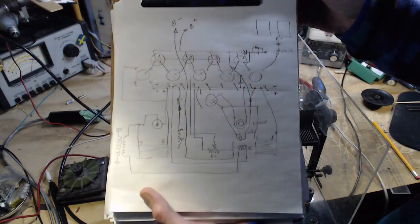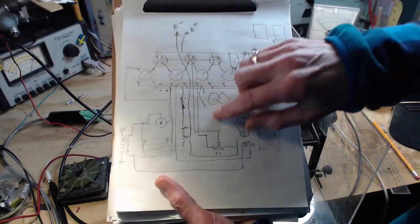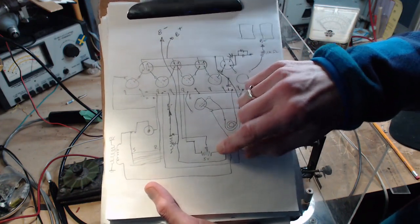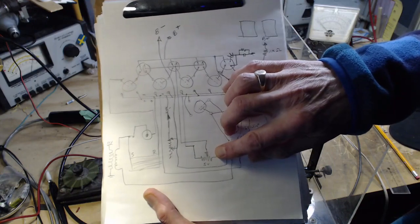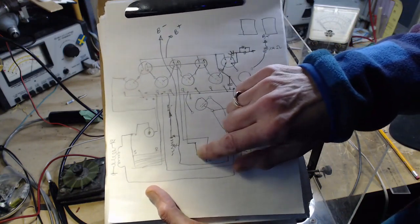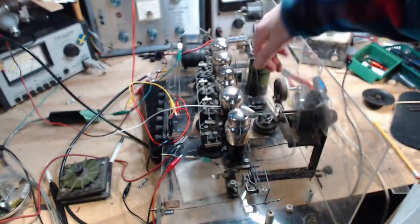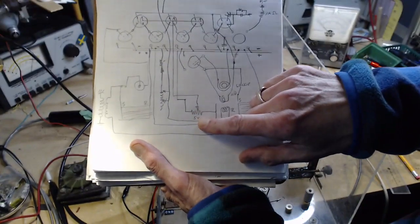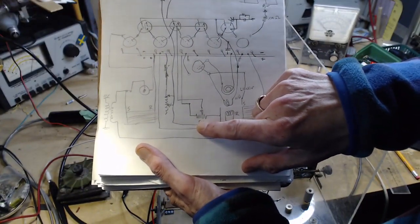Is this really sensible, what I've got here in front of me? Jeepers, I don't know. Look at this control. So this is supposed to be doing the bias. I am going into this whole diagram in detail now because I kind of need to. So what is this variable resistor, right? This is this guy. What is it doing? So it has 5 volts across him. Where's he getting that from?